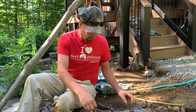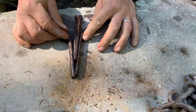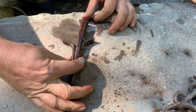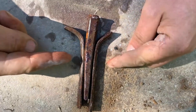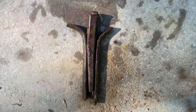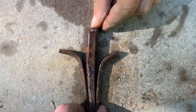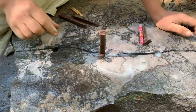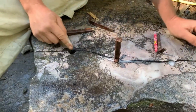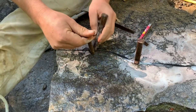We used water to help the grinder along. Here's the feather and wedge system — there's your center wedge and these are the feathers. This is a three-quarter inch hole. As you start driving it down, it just pushes and pushes, and the outward pressure created is more comparable to dynamite than anything you can imagine — incredible PSI. Placement was somewhat strategic because I'm trying to cut an S-turn, and I want this squeezing pressure to connect these dots.